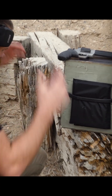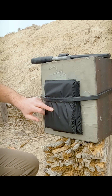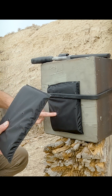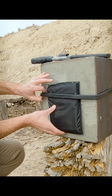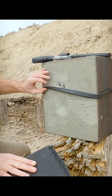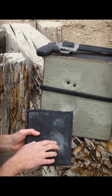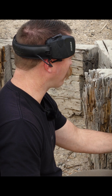You can see that shot right there — it looks a lot bigger than the other ones because it is. So that's our 30-layer panel: blew right through. Here's our 40-layer panel — you can see the entrance. Let's see if it stopped... it did! No pass on the back. That was our first shot, but the second two are closer together than I would have liked. The back face deformation is not that bad — probably 15 to 20 millimeters — well under your 44.